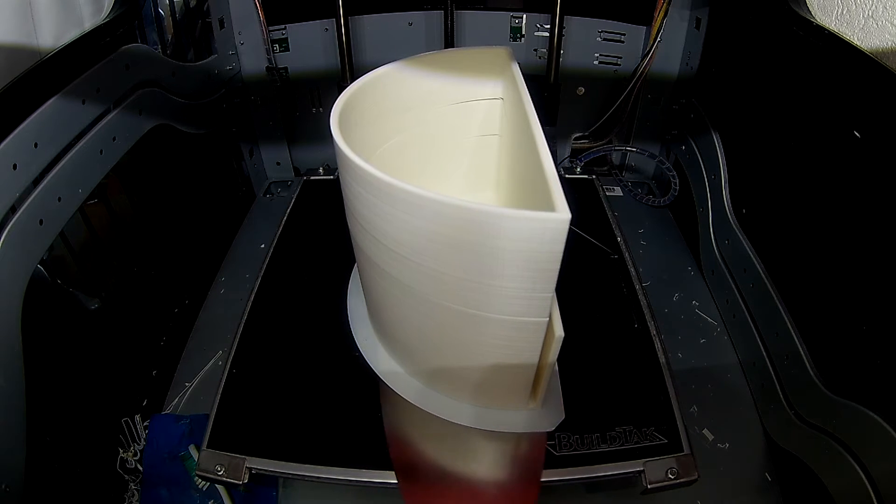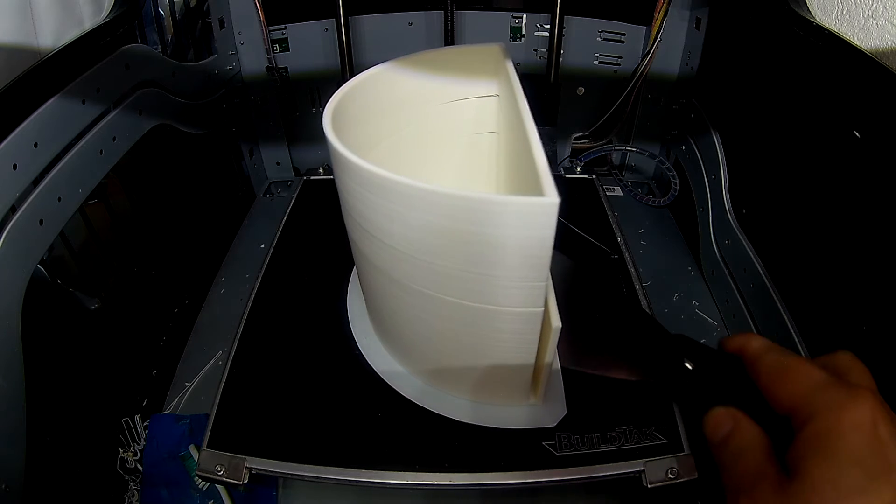The last pieces are being rounded and the whole object will be very strong. The video was sped up — actually eight times faster than I took making the object. It's a fairly simple object, but simple isn't the right word, because I'm going to make this out of ABS. ABS has the tendency to shrink, and this shrinking can cause massive problems because ABS is very strong — it can be so strong that it breaks while printing. This is what you'll see in the video of the printing.